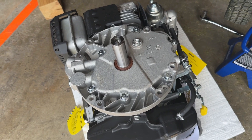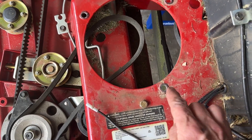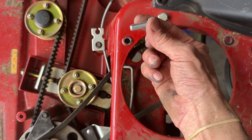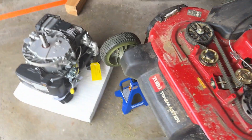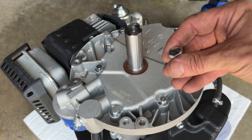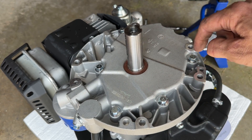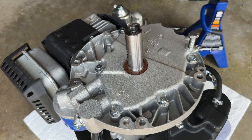I'm going to go ahead and get my tap kit out. Before I work on the new motor, I want to show you something. I realized this one here is not threaded, this one is not threaded, and this one — that's the hardest one to get to — actually is threaded, but it's threaded for a half inch. Another video suggested using a three-eighths inch, so that's what I'm going to do. A three-eighths inch will fit up there nice and neat into each of these. So I'm going to tap this with a three-eighths 16 — that's a coarse thread. I went to the store and bought stainless steel bolts: a three-eighths by 16 by one inch bolt. I'll just tap it right in there. On this Kohler it's going to make a really nice tap, as opposed to tapping a half inch which would tear away too much metal. I'm going to get my tap ready.